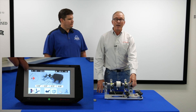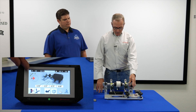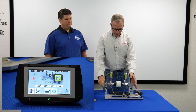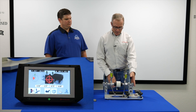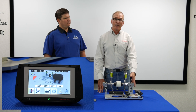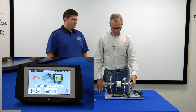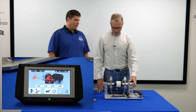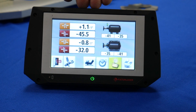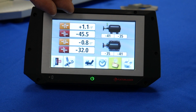There's an area shaded in red on the display unit asking the user to rotate the sensor somewhere near 12 o'clock. I'm simply going to move the sensors up near 12 o'clock — it doesn't need to be exact, just somewhere out of that red shaded area — and I'm going to hit the measure key again. Once it logs that point it asks the user to rotate the sensor near three o'clock. We'll simply rotate over to three, toward the green triangle, and take our third measurement point. This is the result screen. The numbers are quite large — these are in mils, so 45 is 45 thousandths, 1 is one thousandth.